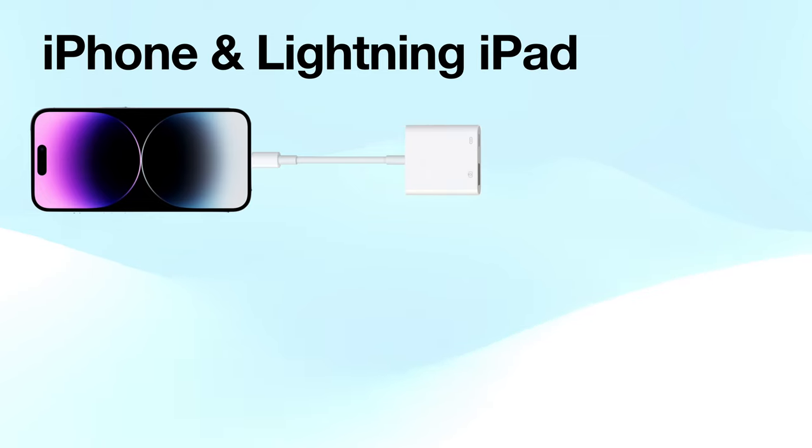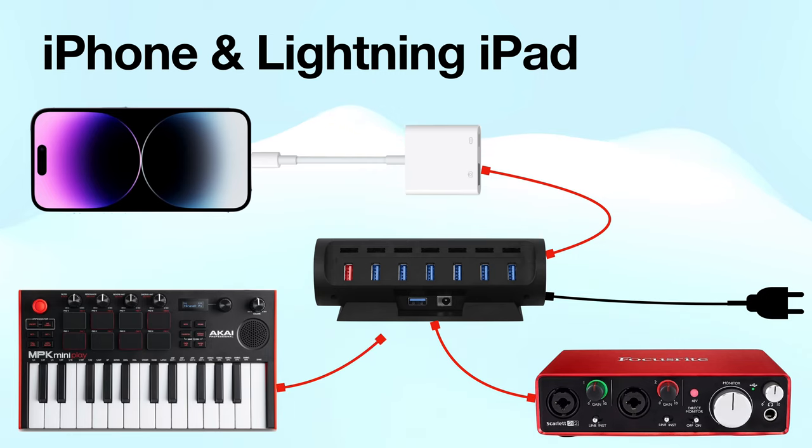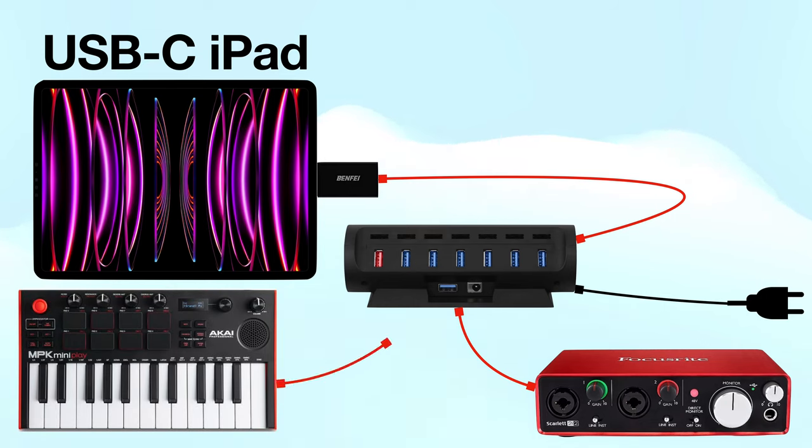For this video, even though we're talking about the gear, we're talking about how you would use that gear and how you can plug it in. Going back to our diagrams: for the iPhone or Lightning connection diagram, what we're going to do is add a USB hub. From that hub, whether powered or not — and you'll need to be aware of what power you're pulling — we can add things like keyboards, MIDI controllers, and whatever you need. With the USB Type-C diagram, it's pretty much the same. Make sure you've got enough connections, and if you don't, you need a USB hub — I would certainly recommend powered, so you don't draw too much power from the iPad and drain it. When you start plugging things in and it does drain too much power, you just get a message saying it's drawing too much power and it won't work.